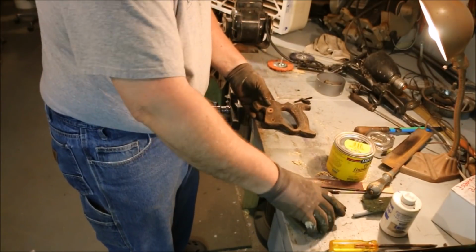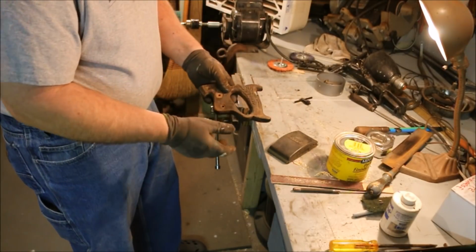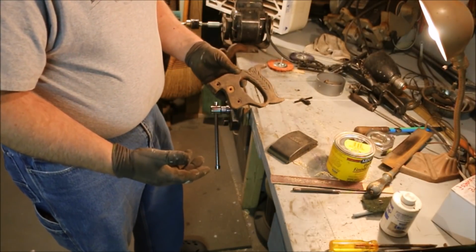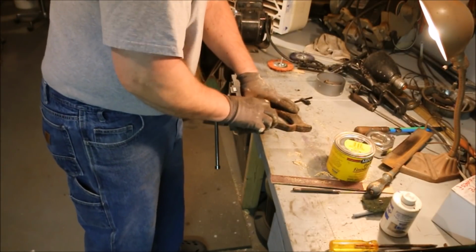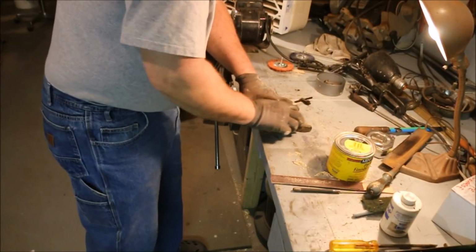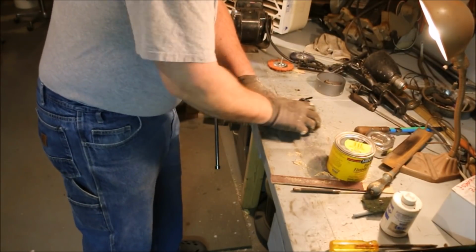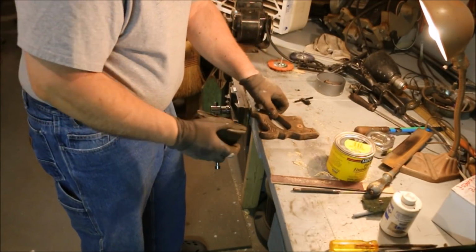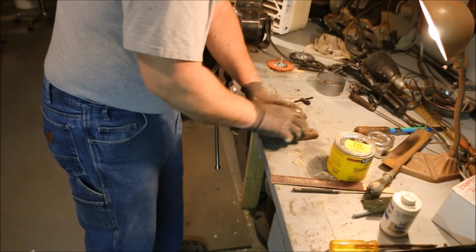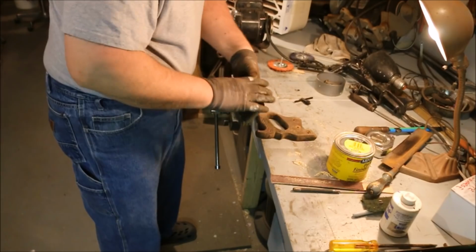Sanding the tote, I usually do with a hand block. I suppose you could go over this with a power sander, but chances are you're just going to gouge it all out. Unless it's been really gummed up where somebody put a bunch of varnish on it, most of the time just going over it with 150 grit is more than enough.